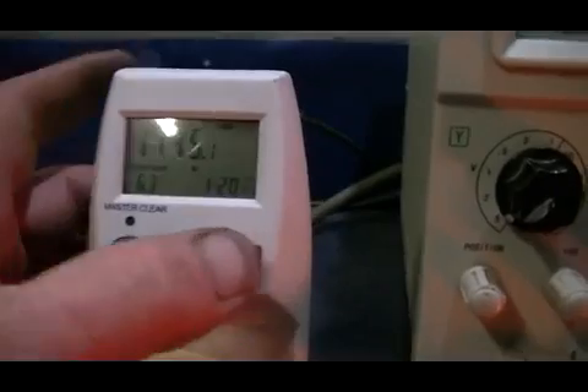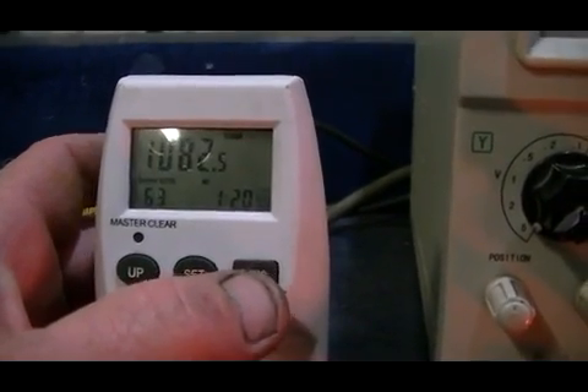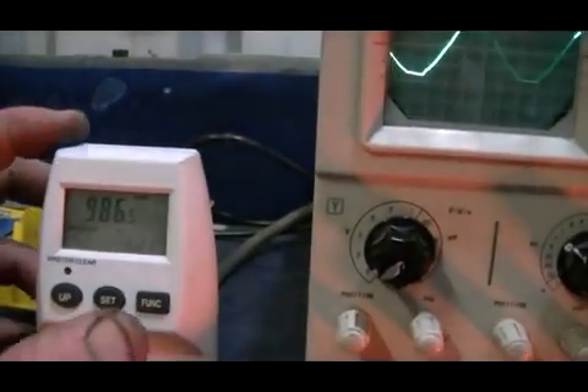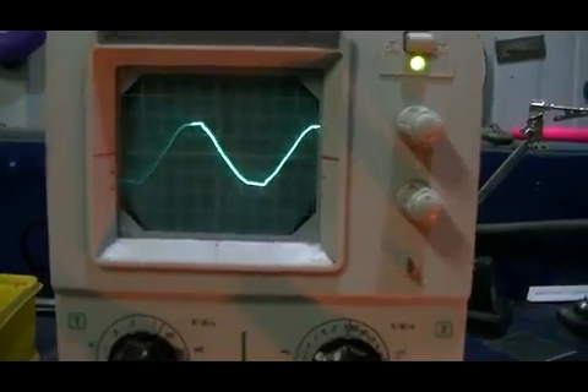There's some pretty good explosions in there sometimes. That's unreal - extremely dry. We're dropping fairly quickly up and down. The power factor is still on 63. Our waveform is fairly clean, so I think the meter is going to have no trouble reading. That's a fairly stable AC waveform - a couple of tiny little bumps in it, but nothing that's going to upset this meter.